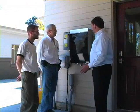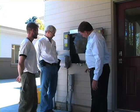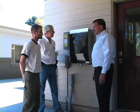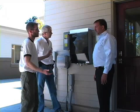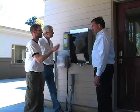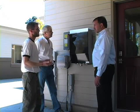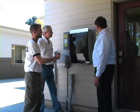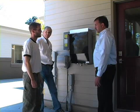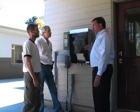So I'm on a home inspection. I come around the corner and I see all this — it appears to be a big box with a heat sink on it, two disconnects, a lightning arrestor. What is it? What you're looking at is what we call the balance of systems — basically everything besides the solar PV panels that are on the roof or on the ground. This big box is called an inverter. That's what makes the power change from DC to AC so that your house can use the alternating current. These two gray boxes are called disconnects, primarily for safety. If I'm going to work on the array, I want to be able to shut off power from it. And this other disconnect is an AC disconnect required by the utility for safety for their linemen — they want to be able to turn the system off if they need to work on the lines in the neighborhood.